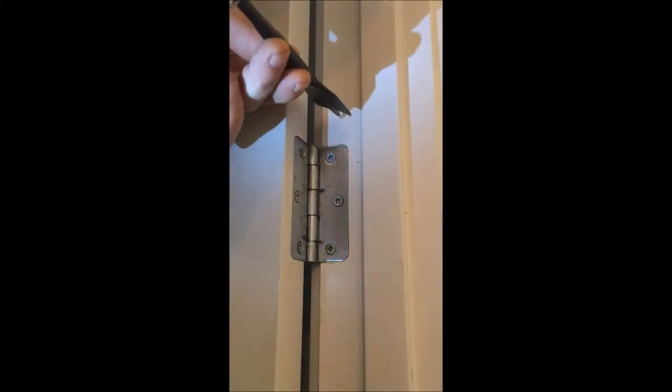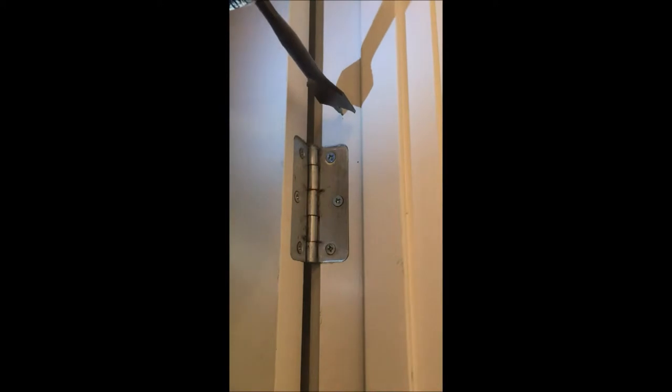I start with a 32mm drill bit. The door gap, as I could see, was around 2mm. The flange is 3mm, so I want to recess this in around 1.5 to 2mm.